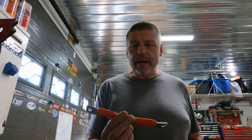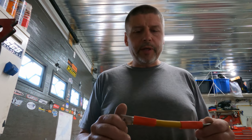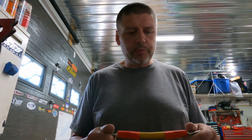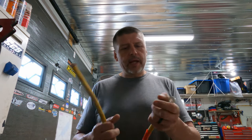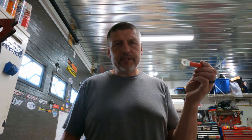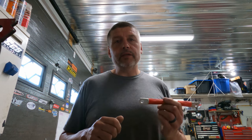I'm starting by creating the battery connection cables. I'm using 1-0 wire, which is a little bit overkill for this installation — I'm only using a 2,000 watt inverter, so this is probably a size bigger than I really need. But I have a bunch of this 1-0 welding cable that I'm going to cut into sections and put ends on. We'll make positive connections to connect all the positives together, negative connections to connect all the negatives together, and then use the same cable to make inverter cables to go from the battery bank to the inverter.